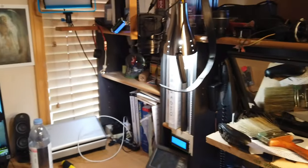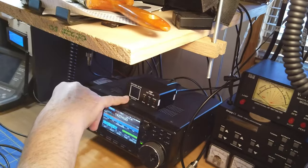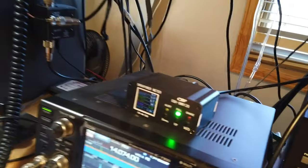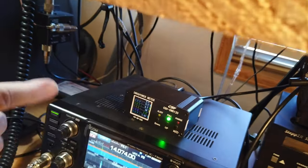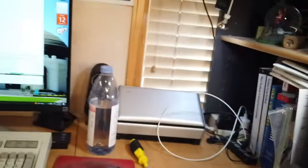Let's see if that's really true. I'm going to press tune again and turn on my little SWR meter here, and press tune. And it says we have an SWR of 1.2. That's very cool. So we're tuned. We're receiving the band and everything. We'll turn tune off.